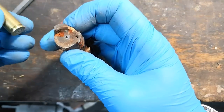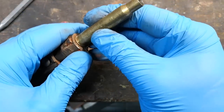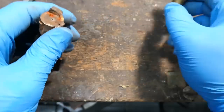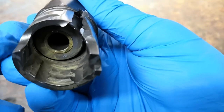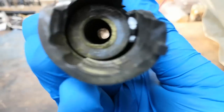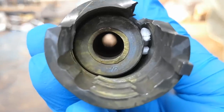So to recap: we know that the yield strength of the material was high enough, as no plastic deformation had occurred before, but it was greatly exceeded during the anomaly. This means that the cause of the accident was overpressure. The very high pressures are also revealed by the fact that the cartridge case body strongly seized in the chamber — that's typical of overpressures, since after the large deformation, the steel of the barrel springs back more than the brass of the case does, and a permanent compression remains in place.